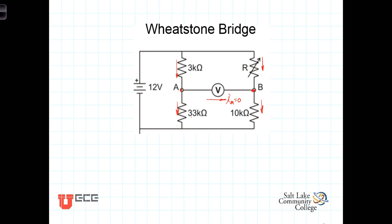When the voltmeter reads zero volts, that means the voltage at A and B are equal to each other. If we call the negative terminal of the voltage supply zero volts, then climbing up from zero to A or to B, if the voltage at A equals the voltage at B, this voltage jump here is going to be the same as this voltage jump here. So V sub A equals the voltage drop across one branch and V sub B equals the voltage drop across the other, and those two voltage drops must be equal when the voltmeter reads zero.